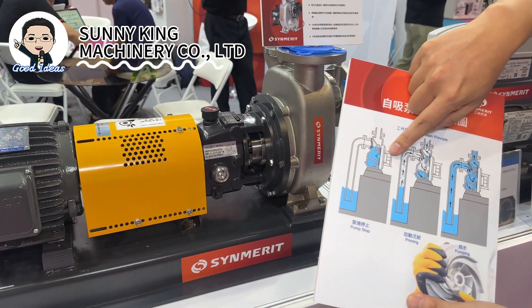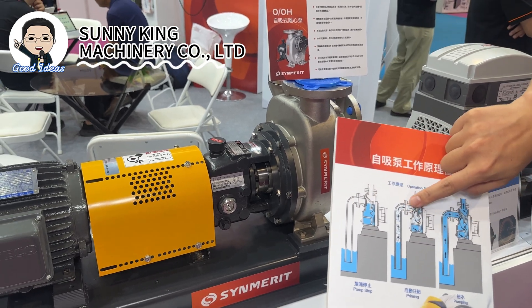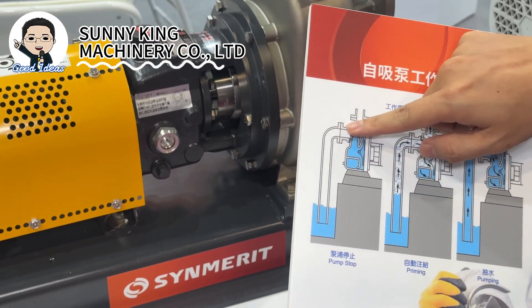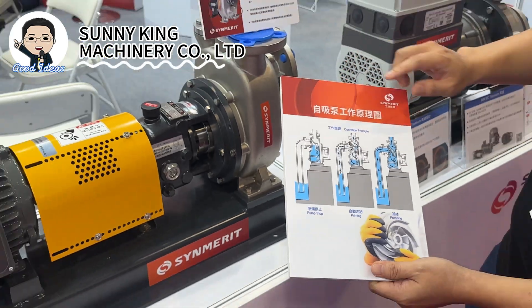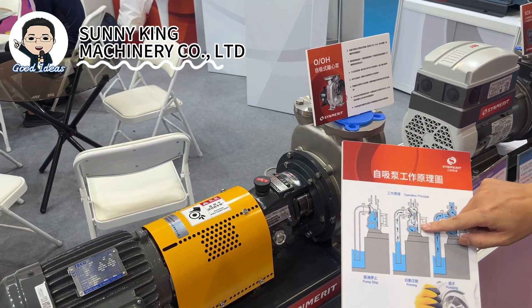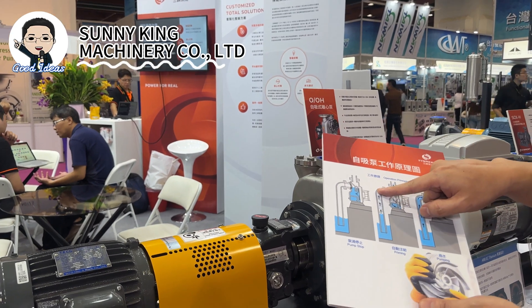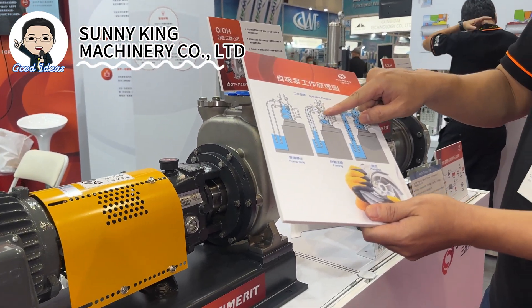You can see the casing is different — it can separate gas and water. Usually a pump needs liquid already in the pipe to pump water, but if there is no liquid in the pipe, the water cannot be drawn in. So we use a self-priming pump. When the self-priming pump starts running, it creates a vacuum so water can be drawn into the pipe and reach the casing.